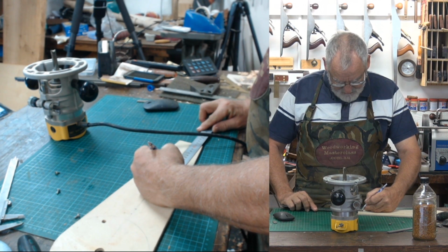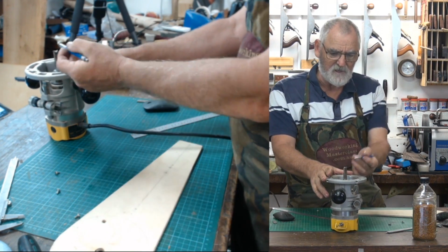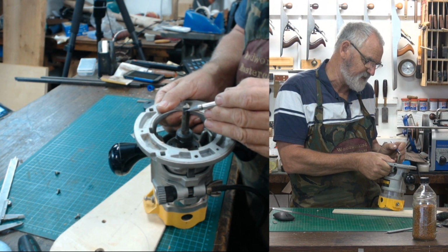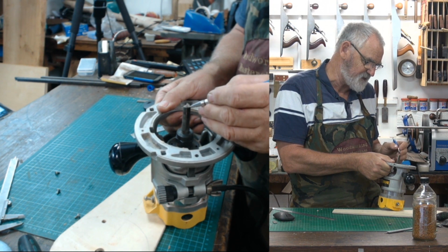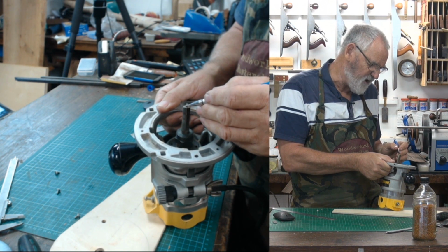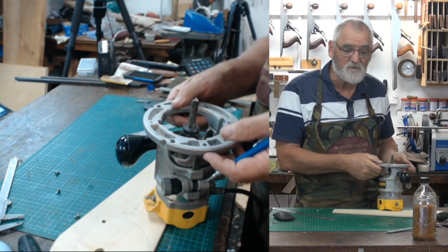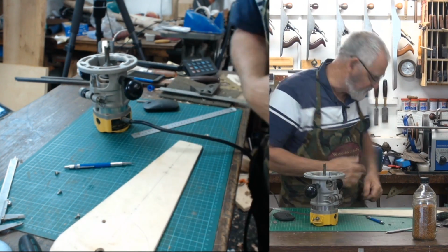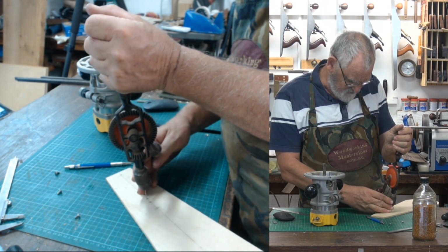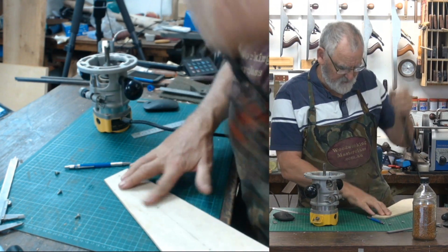which is half the thickness of that. Because you won't be cutting dead centre, your cut line's going to actually be out here. So if you use that as dead centre and you use this, you'd end up with, what, 500 less 12, whatever that is. So it'd be 490, which most likely would do. It's not that critical. And drill as best you can on the centre line. Just like that, that's it.